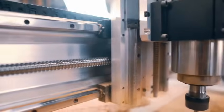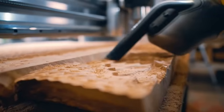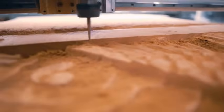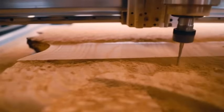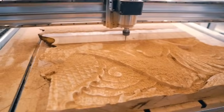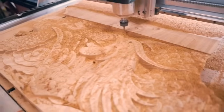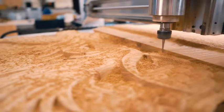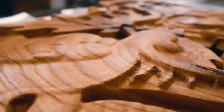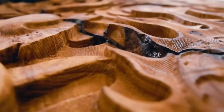Acceleration is a big thing when it comes to CNC routers - that's what takes up time when you're doing 3D carves. This machine has a phenomenal acceleration rate which really cuts down on your run time. This is not sped up - you can tell by how fast they're moving when they're vacuuming. They're using a six-degree taper ball-nose end mill with a very small tip. I'd guess they've got about three hours into this job at this point, and you can see it's starting to pull out that detail. That piece of wood is probably six or seven hundred dollars. The gantry is a big stocky piece of aluminum with a very thick bracket holding it to the rest of the machine.